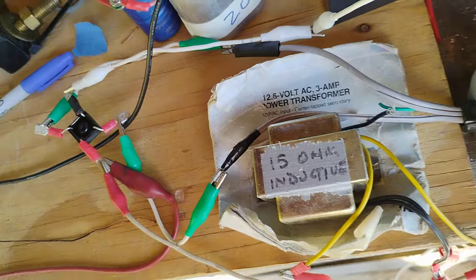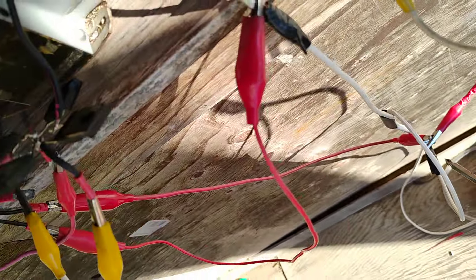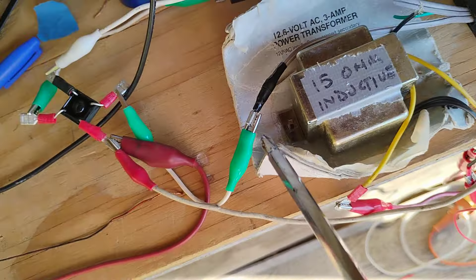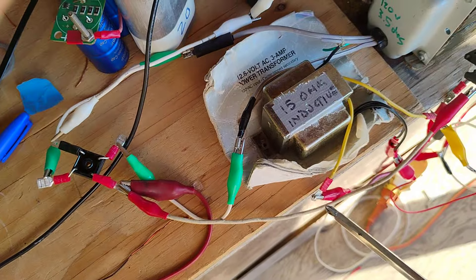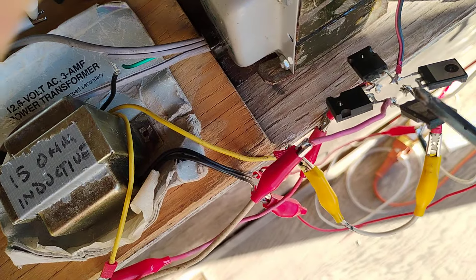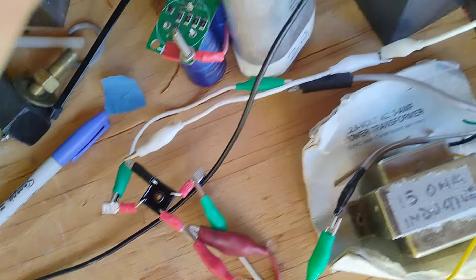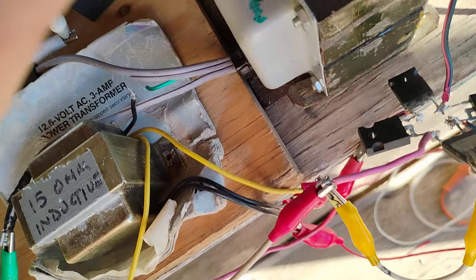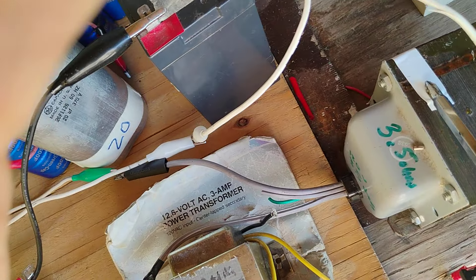I tried vectoring it, but this works really well. You put this transformer right across the AC input on the high voltage side. The low voltage, low impedance side goes into its own full wave bridge rectifier. So I have two full wave bridges — one dedicated to this transformer, the other to this transformer.